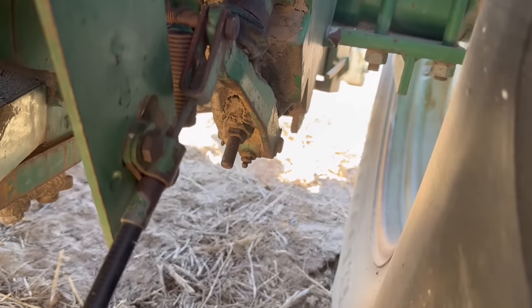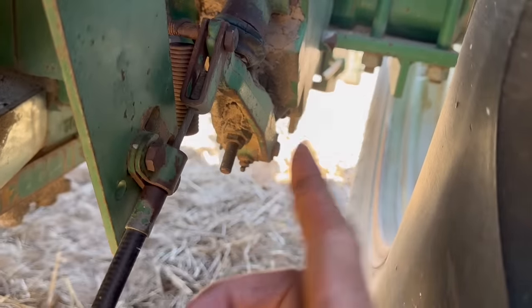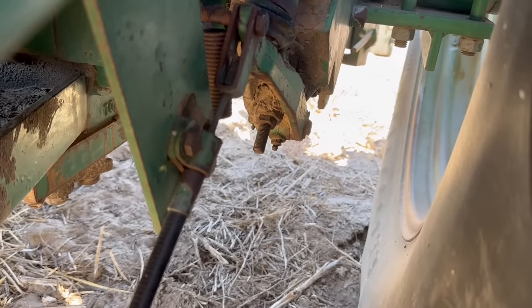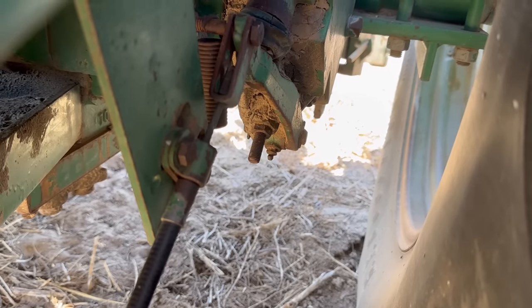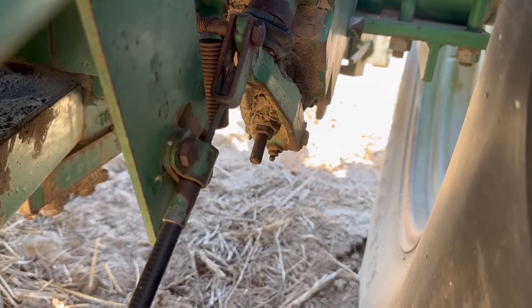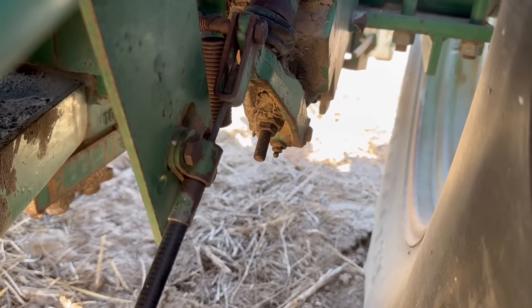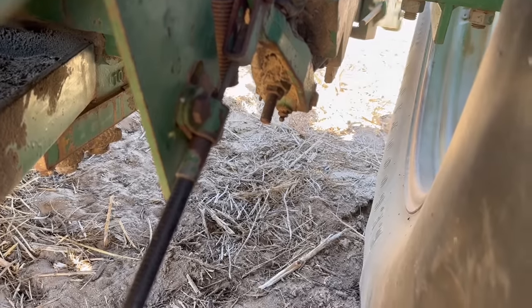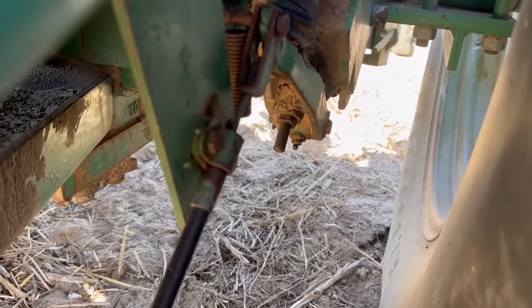So after thinking about it for a while, what I think I'm gonna do here is put my big air jack up underneath somewhere in the back end here and come in and loosen up this tensioner. Maybe smack on the end of it a couple times too. And we'll try to spin the wheel here and see if we can get each wheel spun free. We'll just back those tensioners way off. That way there's no tension on the brakes at all. We can tighten that back up later. I get the feeling it's going to be a while before this thing runs, so brakes are kind of least of my worry right now.